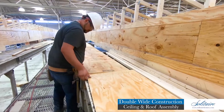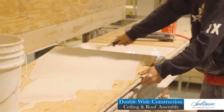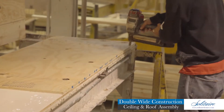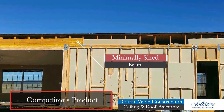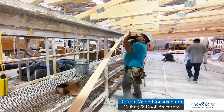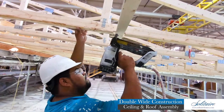Each rafter is set on 24-inch centers and secured to Solitaire's exclusive 24-inch by 3-inch continuous roof beam. Each half of this beam consists of three layers of structurally rated sheathing that is glued and stapled together to form the rigid backbone that supports the center of your home. Other companies cut corners on this key structural element by placing only a minimally sized beam over their openings and rarely run a continuous beam for the entire length of the home.